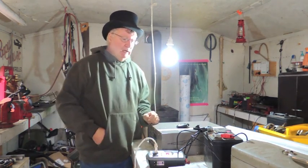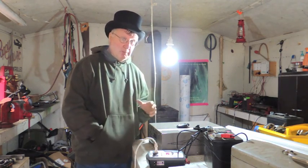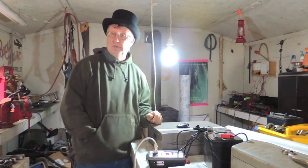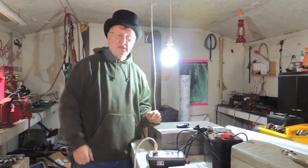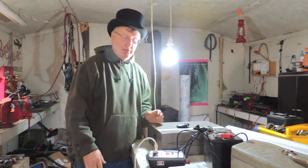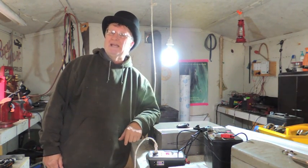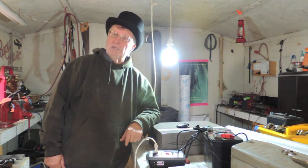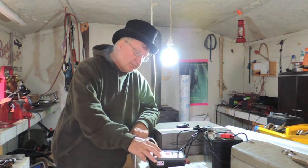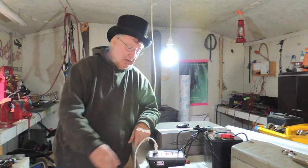I have found that this inverter and windmill setup lends itself well to lighting, and Hugh Piggott — the guy that wrote the book I used to build my windmill — told me that lighting is where they really shine. Because lighting doesn't take a lot of energy and it's not fussy about whether it's square wave or sine wave or even DC. You can usually find some lighting that will run on just about any kind of electricity, and you get a lot of light for a charge on a battery. I expect this is probably going to go for quite a few hours, probably 5 or 6, maybe 10. We'll find out.